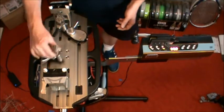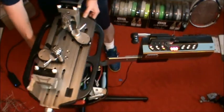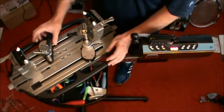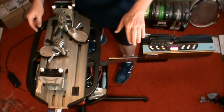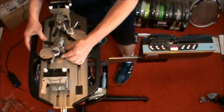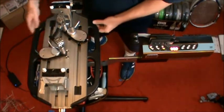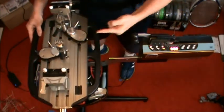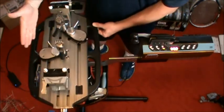But if you've got a swivel clamp machine like this, you want to take your swivel clamp. Let me turn the turntable for a moment to show you this way. So for a moment, pretend like I'm going to be pulling tension in that direction. I want to take my base clamp that's on the far side, this base clamp that's further from my tension head, and I want to orient it in the direction it's going to be pulled, like this, and I want to lock the base. And again, I would lock the turntable, but for clarity, I realize this might be in the way. So basically, I'm going to lock a string in here and pull this way across the turntable.